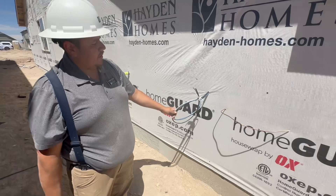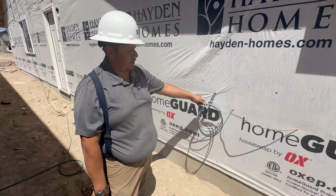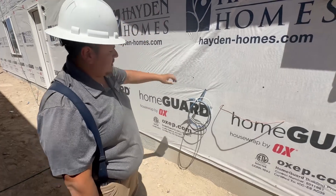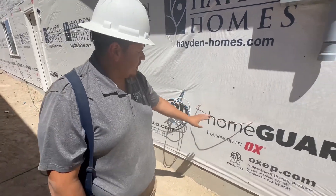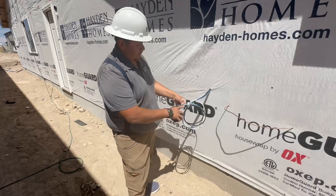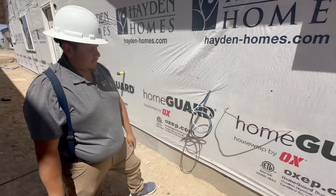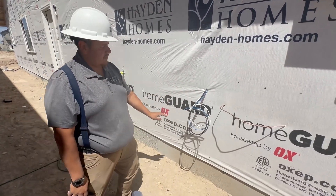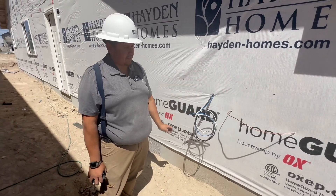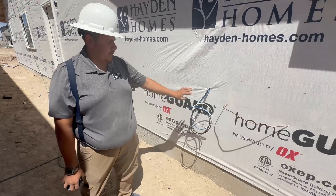These are for your internet cable. It's Cat 5 wire and these are all home run throughout the house. Home run means that it's not spliced — each one goes all the way to one end without being spliced. So the internet and TV people can hook up there and it goes straight into the house; they don't have to add any extra wires. Tell them no if they say they're going to run new wire, because this is all home run to each unit.